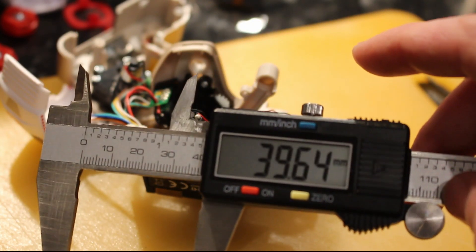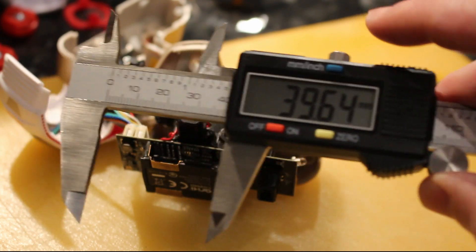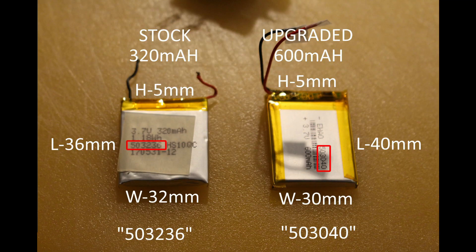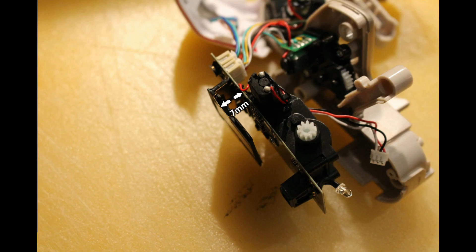What's important here is the length of the compartment because of that IR sensor at the bottom — you are limited to 40mm max in terms of the length of the batteries you can put in this device. I've got a little graphic here showing the stock battery against the upgraded battery; you can see they're pretty much similar in size and that 600 milliamp battery does fit the device really well.